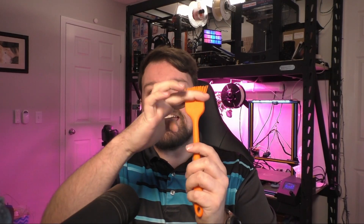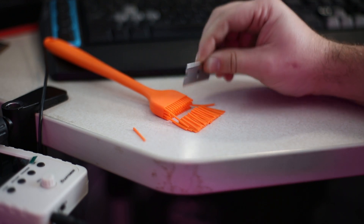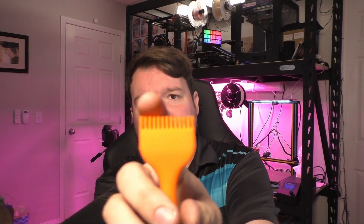We're going to deal specifically with the brush here today. I wanted to use this brush on the hot end, and the first caveat you'll see is that there's a lot of flexibility on this. When dealing with manufacturing PCBs and doing soldering, you'll take a brush and cut it down to just at the end of the bristles to give it some firmness. So I've gone and used a razor blade to trim down the actual bristles to a point where they are still firm but there's still room to collect material. We're going to go from a brush that looks something like this to a brush that looks like this. You can see we still have flexibility, but it's very firm. This is going to be good because we do want to have a little bit of scraping power on that block. You can go cut little edges on it, but for the sake of ease, let's just go ahead and give it a try with this shortened amount.